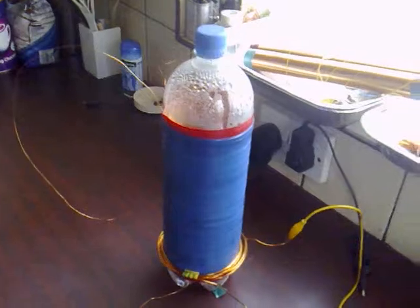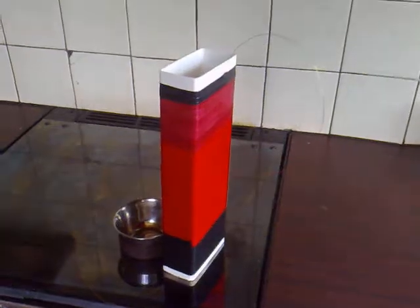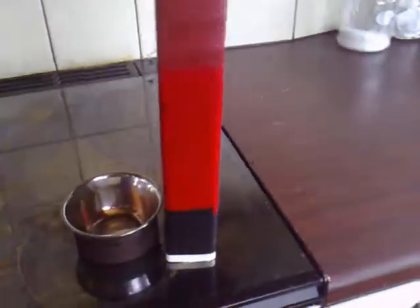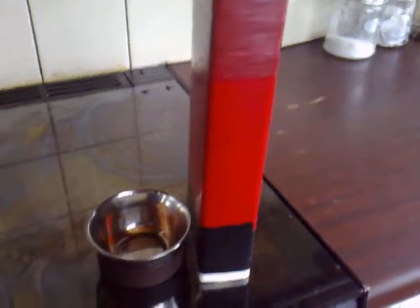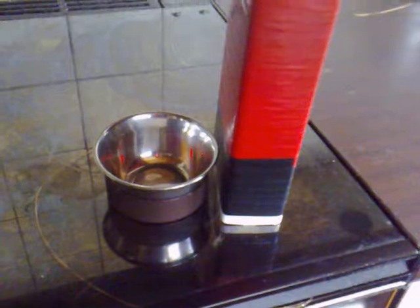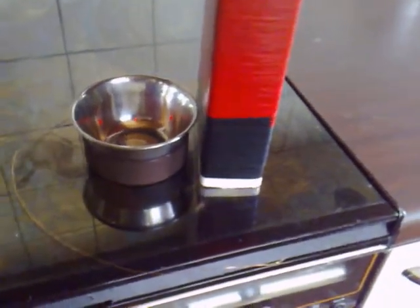The setup today has the exciter as the transmitting tower, sending energy 1.1 meters to a receiving rectangle tower. This rectangle tower is tuned to the exciter via an aluminium pan — it's basically a capacitive coupling between the two. By moving the pan in and out, you tune the frequency, and you also have to jiggle the wires.